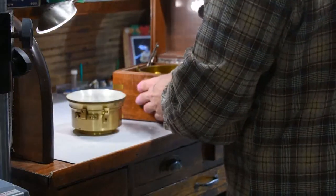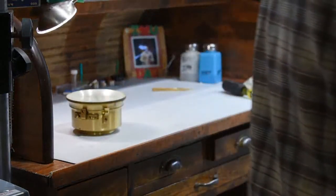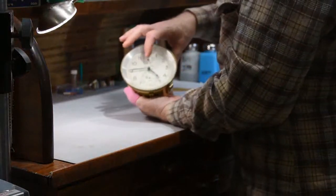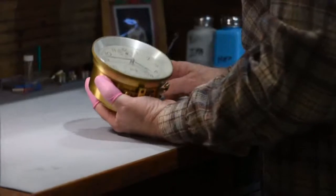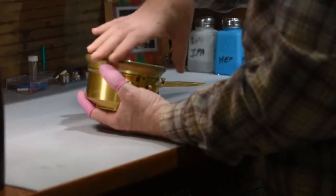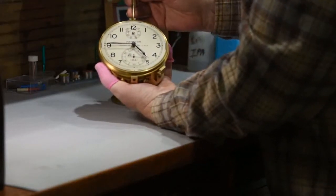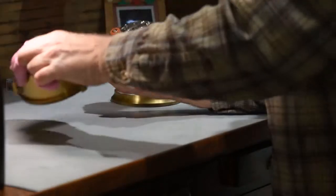As you can tell, this chronometer is in original shape — I don't believe in polishing the brass. Now you can see it has time on it: 24 hours since it was wound. You always want to do this with some state of wind. Unscrew the bezel just like on the other one, and put the bezel down. You still have your keyway and your key at 12 o'clock. Put your quad grip on the threads, turn the bowl upside down, and out it drops.